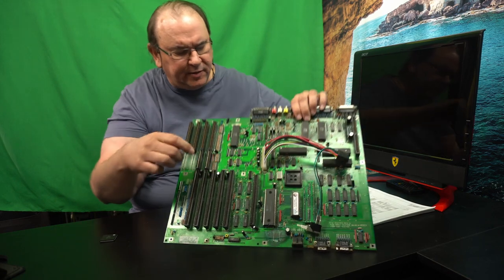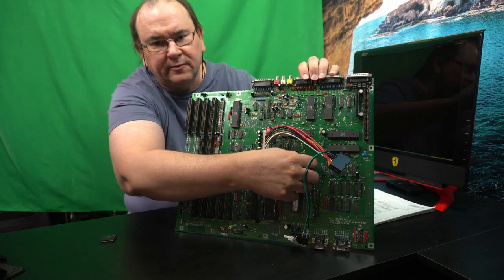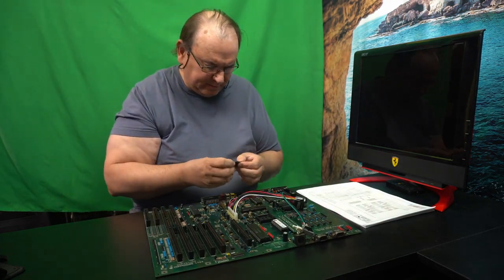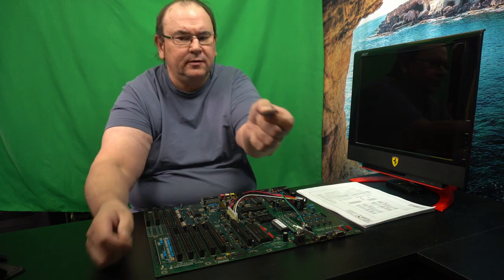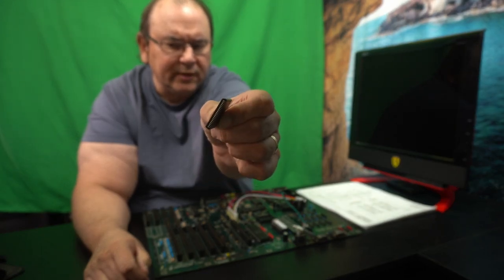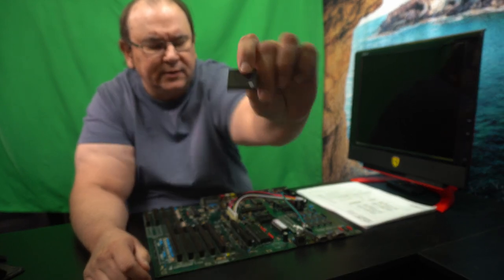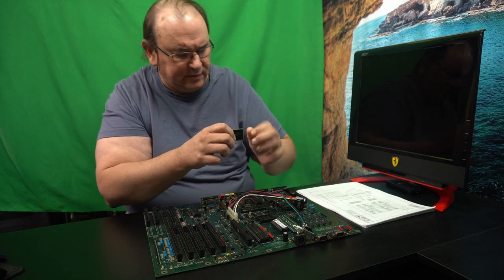you can actually see that now that the board is clean. You might not be able to see it on the camera, but right next to the socket, right down there, there's a number one, and that's the first pin. And if you take this chip, I wonder if I can show it. But you see one of the edges is a bit more cut down. So it's got a bevel on it. And then the number one pin is marked with a little indentation on the chip.